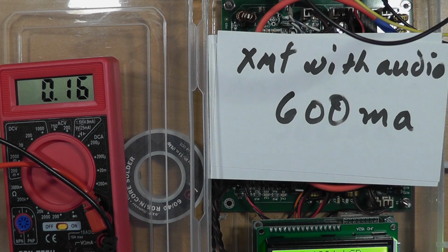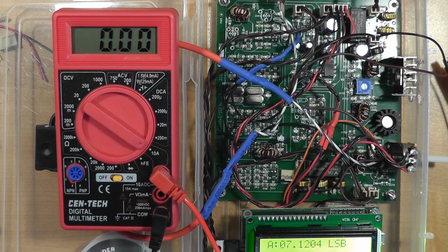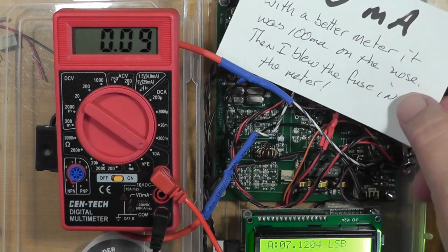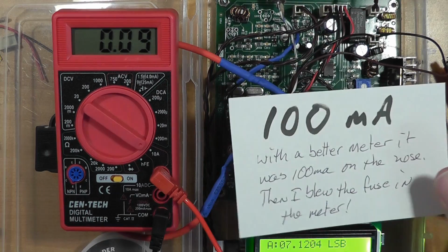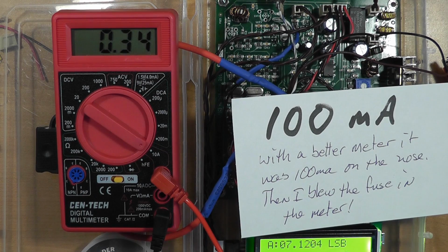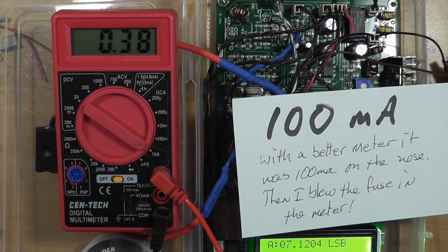should be normal. I also measured the idle current for the power amplifier using the method outlined in the manual and found the transmit idle current was right where it was supposed to be. Yet, speaking loudly into the mic did not provide anywhere near the 1 amp or 1,000 milliamps of current.